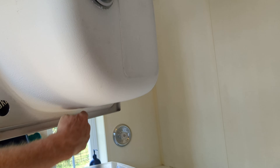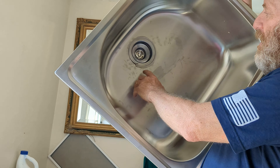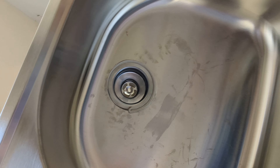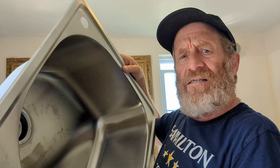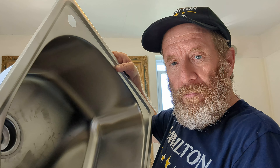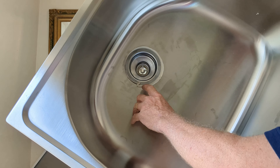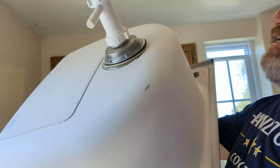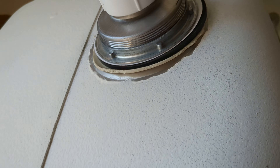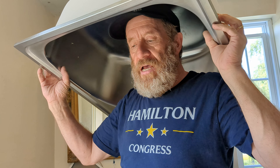Now here's a quick pro tip. You get gaskets with these things, and everybody's like, 'I put the gasket in and it's leaking.' My daughter said, 'Dad, I put the gasket in and it's leaking,' and I said, 'Do you know about plumber's putty?' She didn't — but then she used the plumber's putty and all things came good. A lot of times what you'll do is roll a jelly-roll of plumber's putty around there even though you've got gaskets. Plumber's putty will adjust for irregular surfaces.